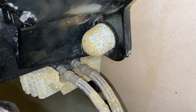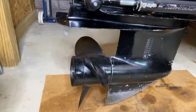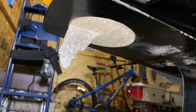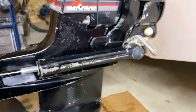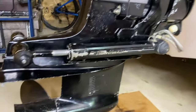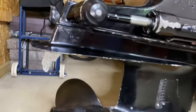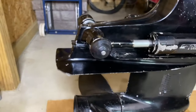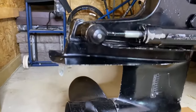As you can see, what a difference. I'm not sure if these are the originals, but we are going to replace them. Coming to the back of the outdrive, just above the propeller, underneath there is your cavitational plate anode — check that out. It doesn't owe us anything; it has done its job. Basically no corrosion on the outdrive itself — some missing paint, some pitting, but that's okay. No large sections of the outdrive or skeg just falling off because it's so brittle and corroded, because again, the anodes did their job. We are going to start with the cavitational plate anode, position the camera, and remove this little plastic plug to gain access to the inner bolt that holds and secures it in place.